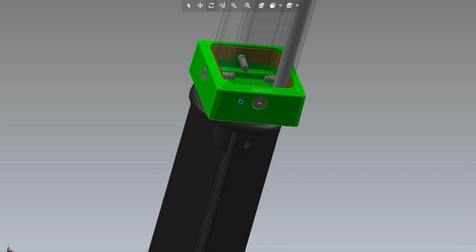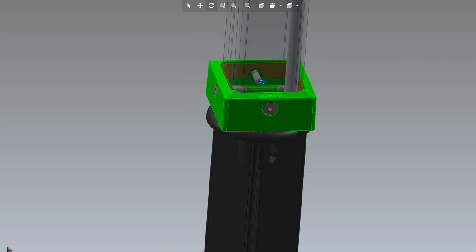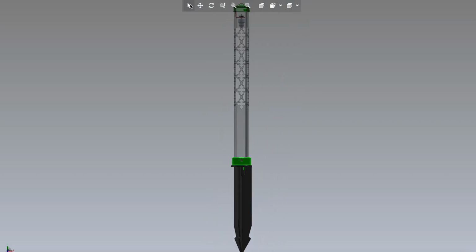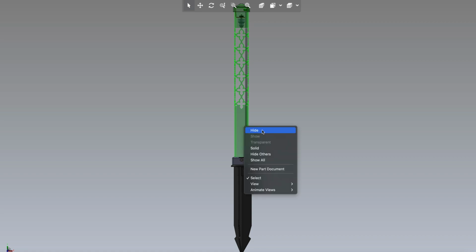So these features basically give it a stronger base, so it's not going to be leaning over because it's top heavy. It's a nice solid heavy base, probably weighs 1.5 to 2 pounds of brass, and then everything is threaded through the brass. You don't have to worry about steel corrosion, so these stainless steel screws will be easily inserted and removed. We add anti-seize to all the threads before they leave the factory. Obviously, we have a large stake, and let me zoom out and show you the zoomed out version, and then we can wrap this video up.